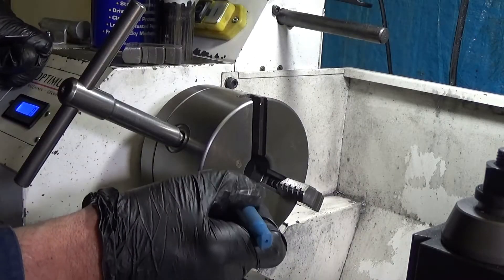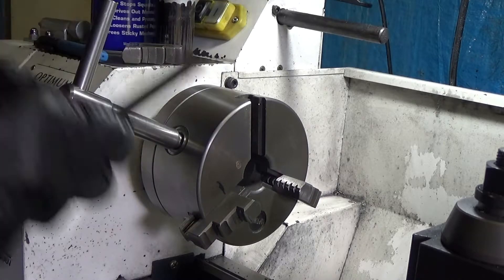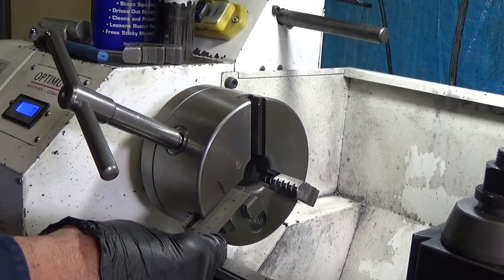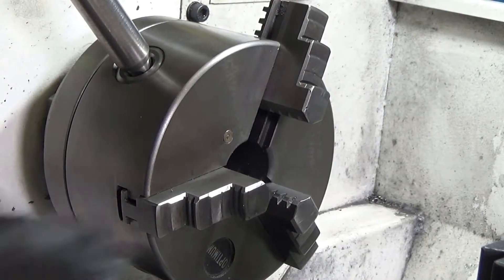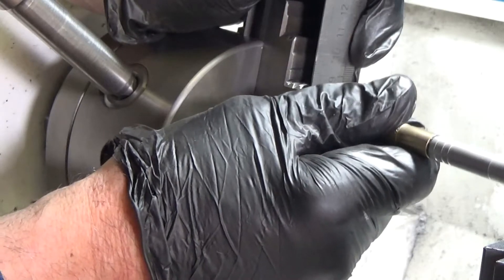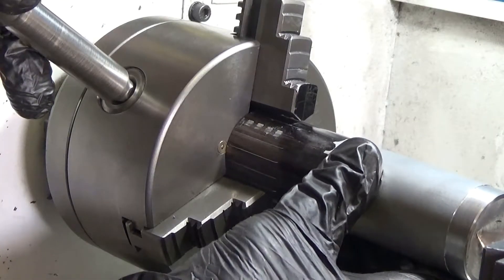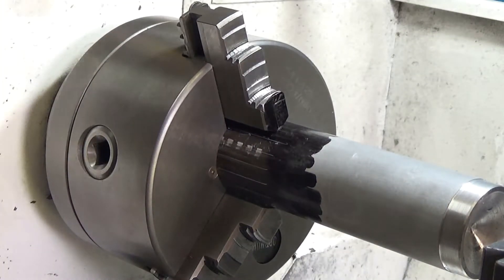Now this is the bit of cunning stuntery that I learned from My Mechanics Insights. Even though I'm using a three-jaw chuck that self-centres, I take one jaw out and just wind two jaws in. Basically I'm winding it in the amount that I want the diameter of the small discs, and then I put the third jaw in, which will be offset — very magical. Now I'm marking that offset jaw and just putting a scribe mark on it so that I can line that scribe mark up with the scribe mark on the material, so I can have it in exactly the same place every time as I move the scribe marks around.